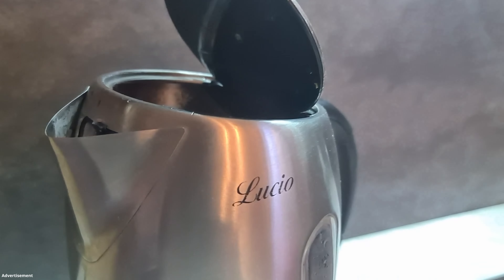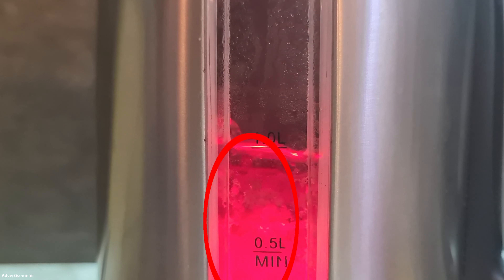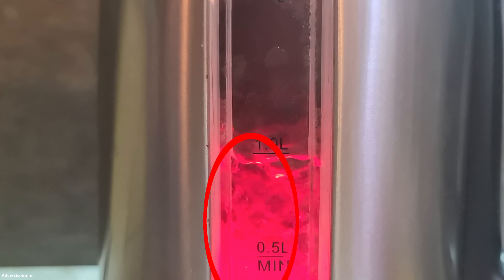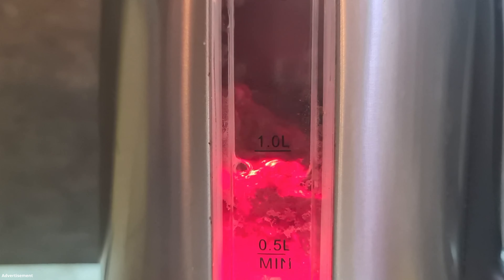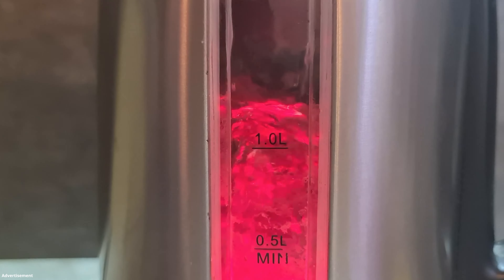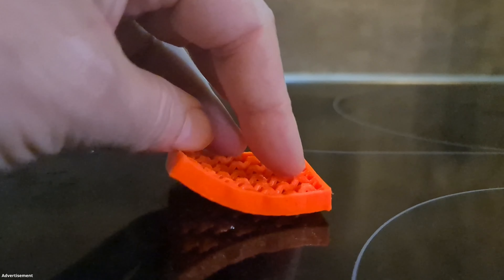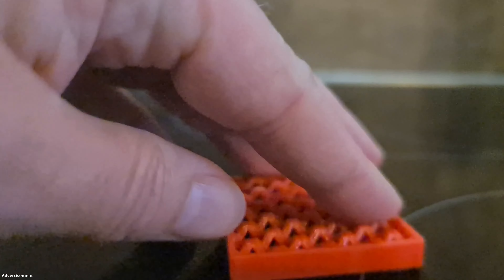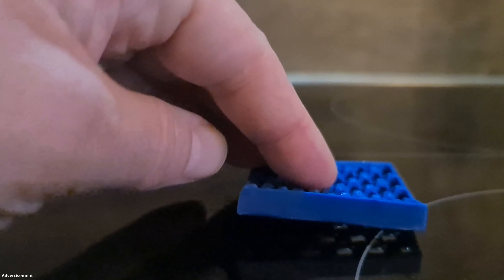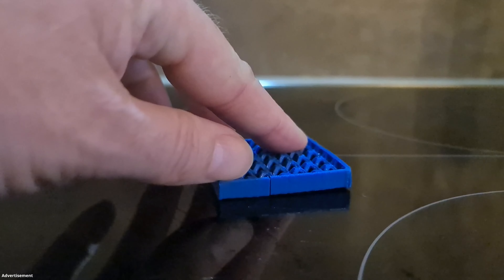In the final run-through, the parts will be cooked. In the last test we see PETG, which could deform very easily while hot. PLA+, on the other hand, is quite tough and stable. ABS broke through in the bending test, and the same happened with ASA.